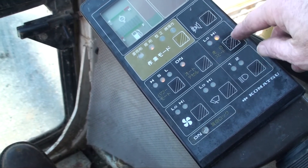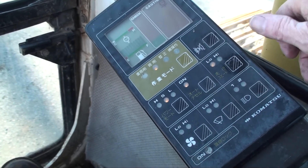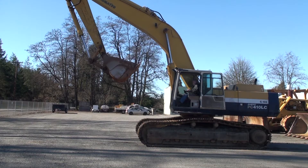The low-high mode on this panel is for the two-speed travel. That will also shift itself down when it comes under a high load. We also have indicators when a function is operated. Pressure switches in the system tell the computer that something's being operated and it needs to change the setting or position.